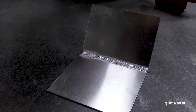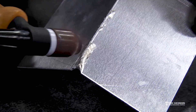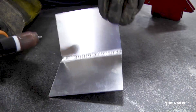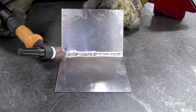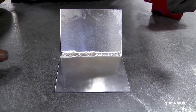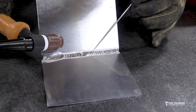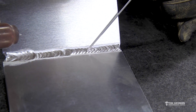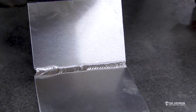See that's hot - it didn't take much pedal to do that. That weld's not horrible but it's way too hot. If I flip this over you can see how much burn through there is - it actually burned through on both sides, almost melting it away. That's too hot. This is what you want to see - penetration without any burn through. You can see how flat and wide it is when it's too hot because it's almost like water, it just wants to run out and spread. And this right here is where I restarted - so on this thickness of material this is the kind of weld you're looking for.